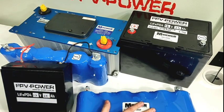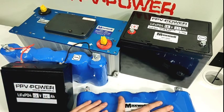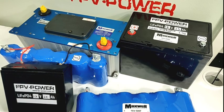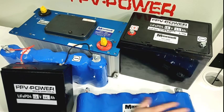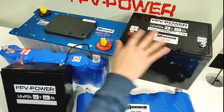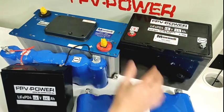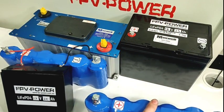But the idea of the most optimal is to have a battery pack in conjunction with a supercapacitor. So whether you have a lead acid battery, which is your cranking battery at the moment, your starting battery, you can have that and add a supercapacitor in parallel. So this is our hybrid. This is a prototype. But for this example, let's treat it as a lead acid battery, a cranking battery. So what I've done in my camper van, to give you an example of how well this works,